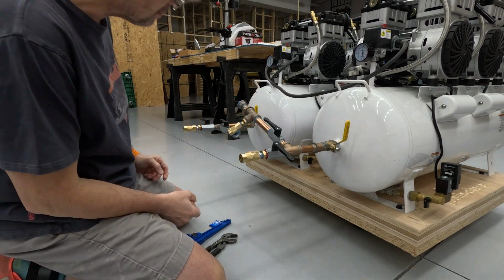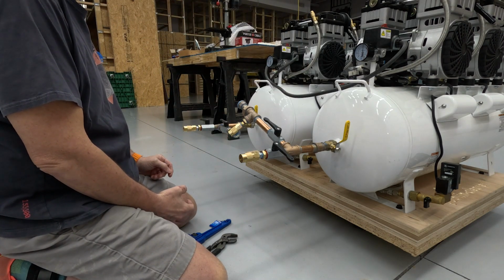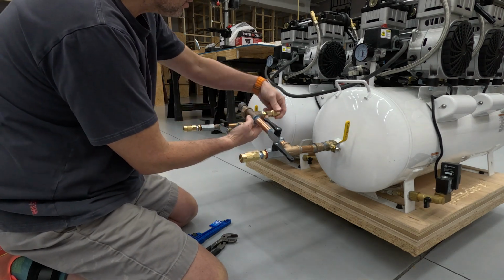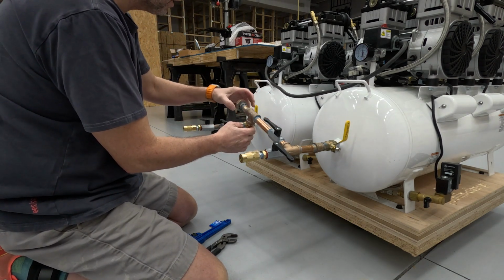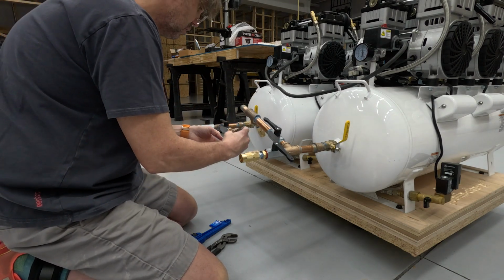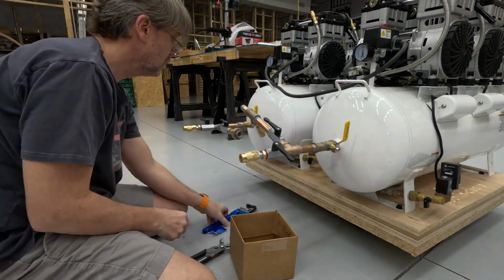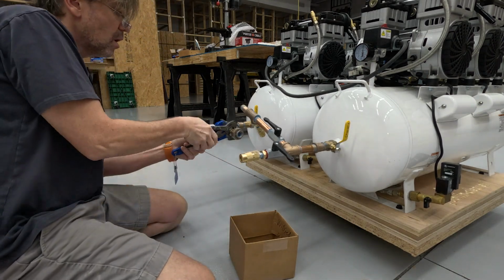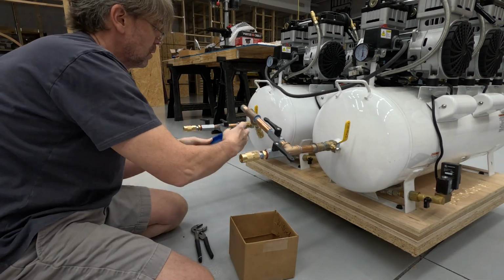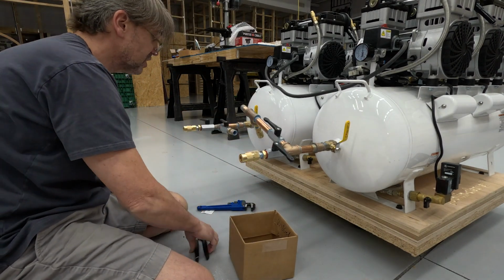The other problem with the pipe sealant is all of it being inside of the pipe, so that's all going to get thoroughly cleaned out. I'm going to disassemble everything here and quite frankly, get everything over to the sink and completely dry it all. In all fairness, it didn't leak anywhere where it was tight.